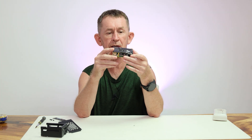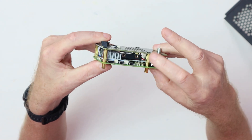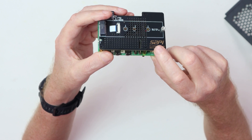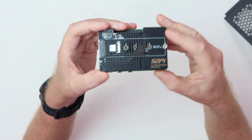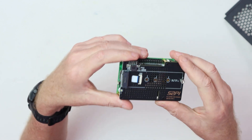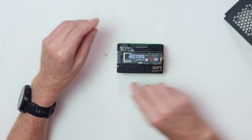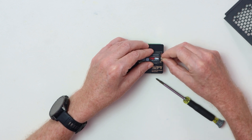My daughter and I put it together and it only took a few minutes. We put the small standoffs joined to the big standoffs so the board sits up from the bottom of the case. We screwed the HAT down with the screws that came with it. The ribbon cable was much easier than I thought — I put it in before I screwed the HAT down, being very careful. Now we put in the M.2 card — it only goes in one way. Push it in at about 30 degrees, make sure it's in all the way, then screw it down.